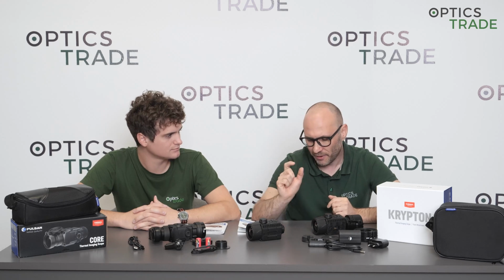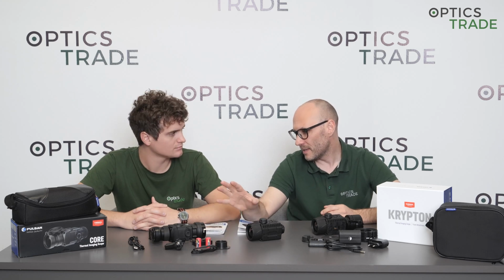Now on this new device, honestly speaking, Core has been in production for a lot of years. I would say, I didn't check, 6 years or something like that. They did come out with upgrades. The first generation of Core had a sensor with 25 micron pixel pitch. Then the second generation had a 17 micron pitch. Then the third generation, this one, came out with a black and white image instead of black and green. So it's really a device which has been on the market for years.